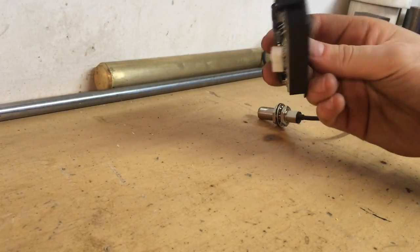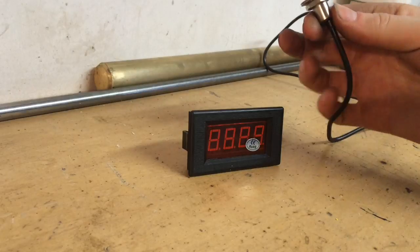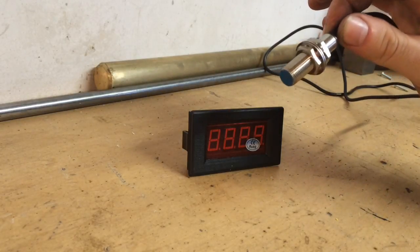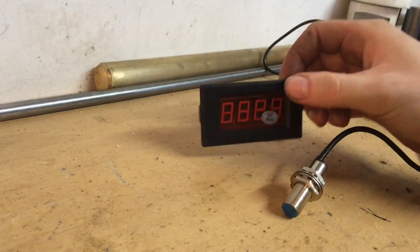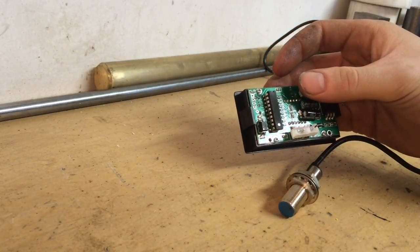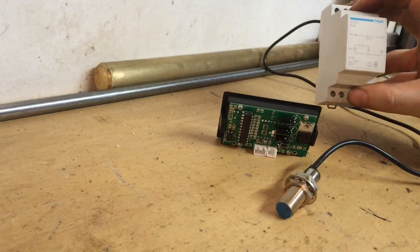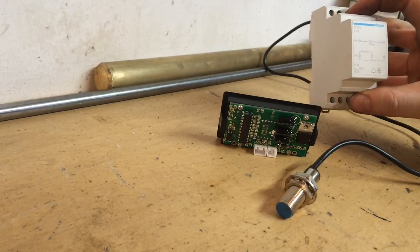This is a digital tachometer for my lathe — it's just going to read the spindle speed. It uses a magnetic proximity switch, so I just need to keep it close to the spindle. I've got a small neodymium magnet attached to the spindle which will send a signal to this to read speed. To power it I need either 8 to 24 volts DC or 6 to 18 volts AC, so I've bought a doorbell transformer — it's overkill, this needs nowhere near that amount of power, but it does 8 volts or 12 volts AC, which is perfect.